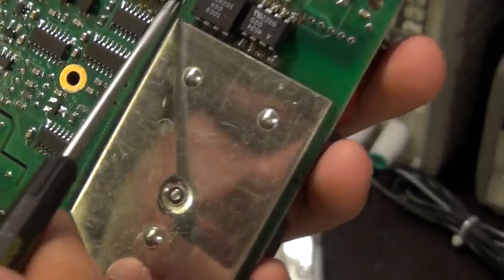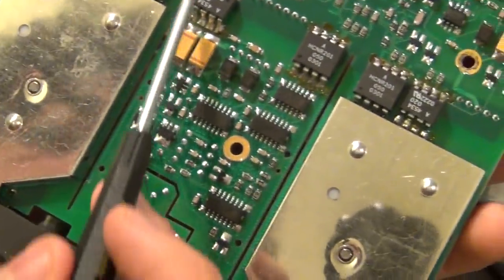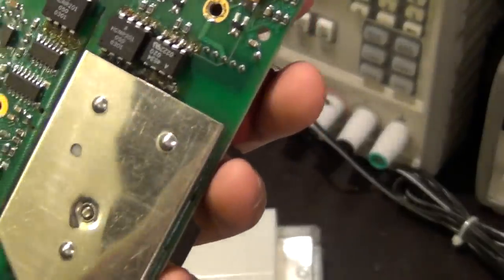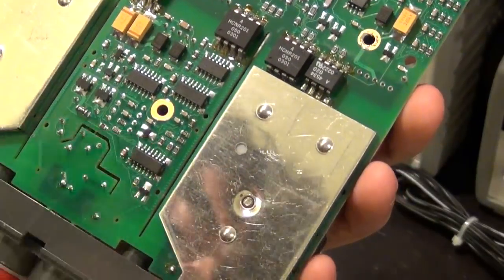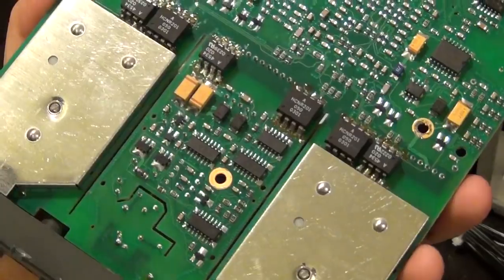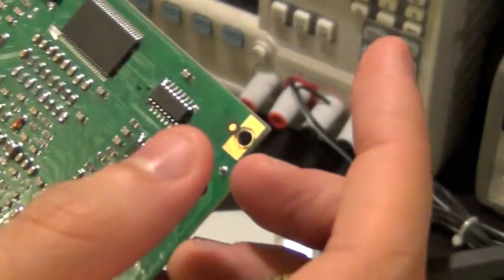And you can see that they have completely shielded the channel, the circuitry that's for the highest speed input channel on the left and the right one, directly from the center. They've cut out all those little notches to make sure there is as little crosstalk between each of the sections, because you can have all three of them active, and even though you're not using this, you may have it, for example, connected to the main, and you don't want it to pollute the other channels, so you can read good measurements. So again, here's some memory, some ST memory at the back.